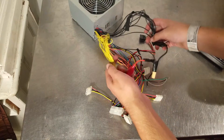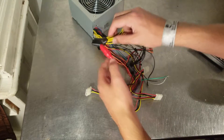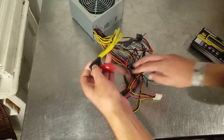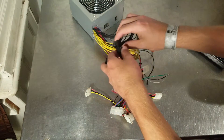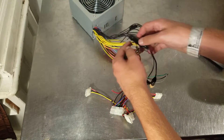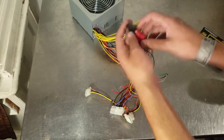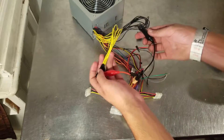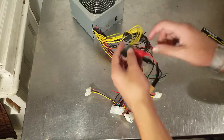Once you do that, you're going to want to — as you can see right here — I had them soldered together, both yellow and both black. You don't absolutely need to solder if you don't have a soldering tool; you can just twist them up. The reason is because of these little clamps right here — you have to make sure they have a good connection.